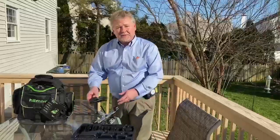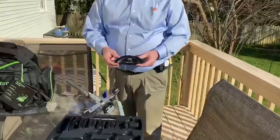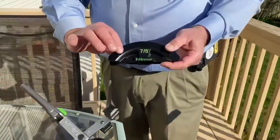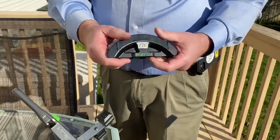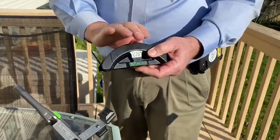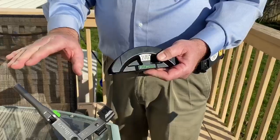Another feature that's important to mention is that the mandrels are aluminum. The ones that are plastic in the competition will warp and flex as you're bending your tubing and make it difficult to remove the tubing. Being aluminum, that will eliminate that difficulty.